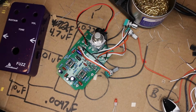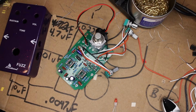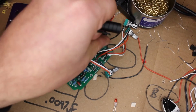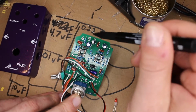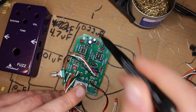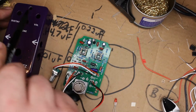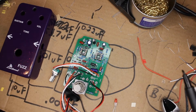Now it's time to deal with the issue of the LED, and I say the issue because as you saw with the potentiometers, the board is not in agreement with the case. And on our board, the LED is over here. Actually, let's flip this around so it matches the case. Our LED is up here. That's the positive, and that's a negative right there. That's off center from this jack up here, this hole up here. And I want that to line up.